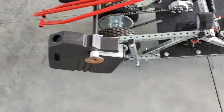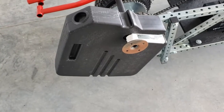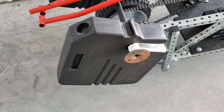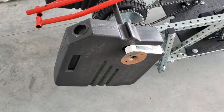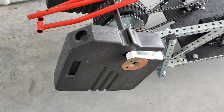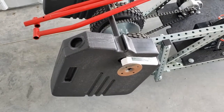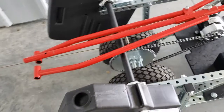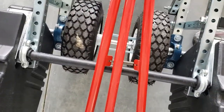On the front we have two suitcase weights, primarily used on lawn and garden tractors. If you put a blade on one end you need to counterbalance with weights on the other end — that's what these are for. They're hung on a pipe to add more weight to the front and give the drive wheels more traction.